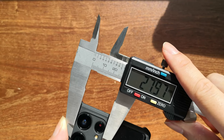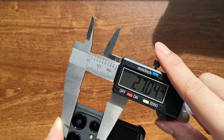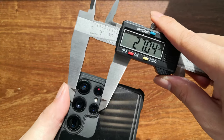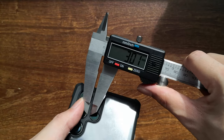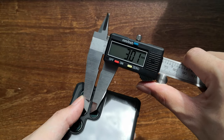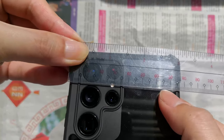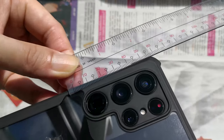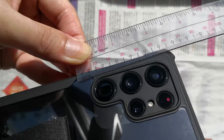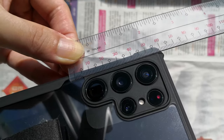The telelens sits on a perpendicular line from our earlier measurements, which greatly simplifies the job ahead. The outer distance between it and the main lens is 27mm; the inner distance is also 3mm, giving us a 15mm center-to-center distance between the main and telelenses. As for the adapter plate itself, 60mm wide by 40mm tall seems like a good starting point. We'll still trim to fit afterwards since we need to avoid getting in the way of the ultra-wide lens and flash.